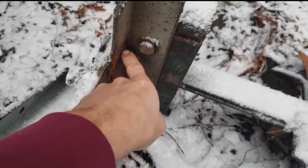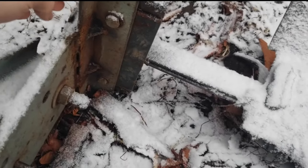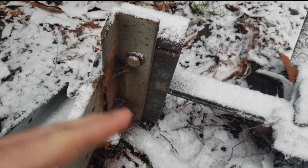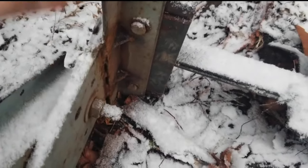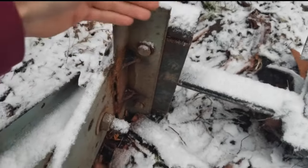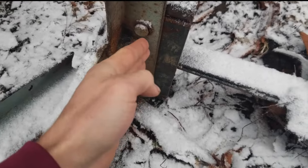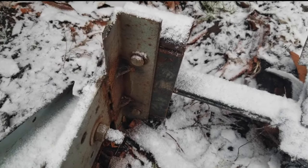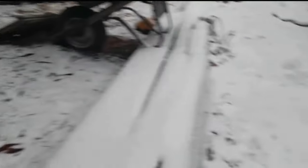Got some gusset pieces here just to strengthen the web of the angle iron. So that will never break now - at least it shouldn't - because the tractor was popping wheelies, wanting to hit the roots and try to pull through them. Now with it being on the bottom, when I put my grader blade back on, I'm going to build more like a grader blade, less of just a bar - so it'll actually have some bladage to it and some curve. So it'll be able to turn 180 degrees now, and I can use it pushing backwards if I wanted to.